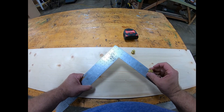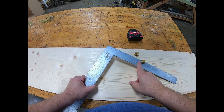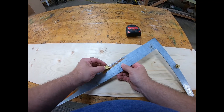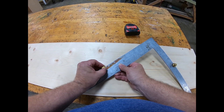I'm going to set this one on seven — I'm going to put the edge right on seven with the stair gauge on seven — and then this one I'm going to put on ten and a half. So you line them up on those numbers.